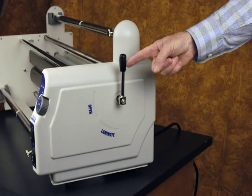In addition, the open position accommodates a much easier threading of a cold laminator prior to turning the unit on. Also, in the event of a wrap-around, when laminating film rolls onto the pressure roller instead of exiting the laminator, the wrap-around can be corrected in the open position by pulling the film out. Never use any sharp instrument to cut film from a roller, as this will damage the roller and require replacement. When the lever's black knob is pointing straight down, the laminator is in the laminate position for normal operation.